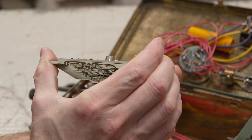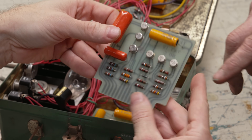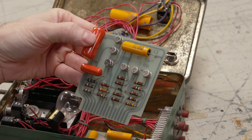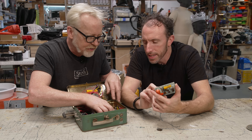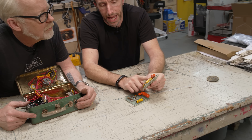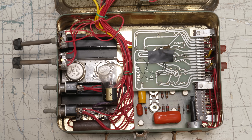What did this thing do? What is this card for? Is that a transmitter? You have just a bunch of standard resistors, some capacitors, and these are probably just transistors. I'm guessing this is just a transistor switch card with biasing resistors. It may be amplifying something, but it's hard to tell. There's a second card — this one has some potentiometers on it, which tells me this is probably acting as an amplifier, with the transistors biased in their linear range doing some kind of amplification.